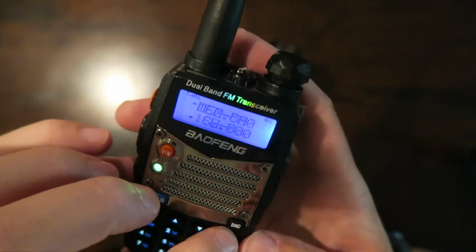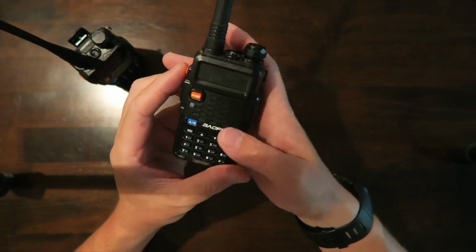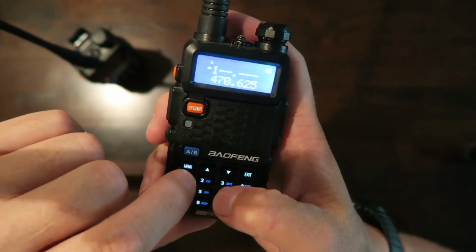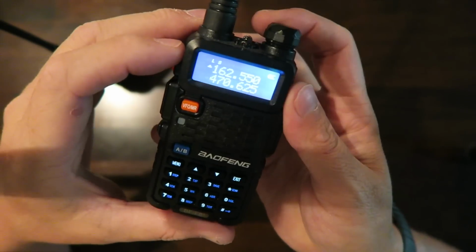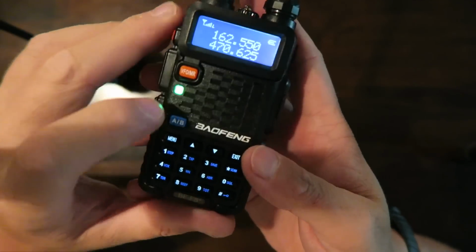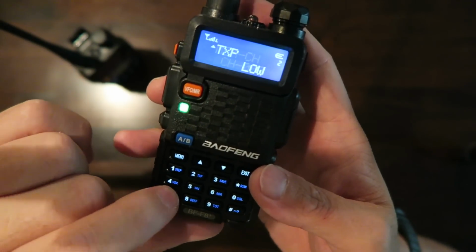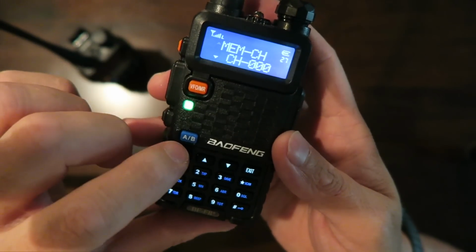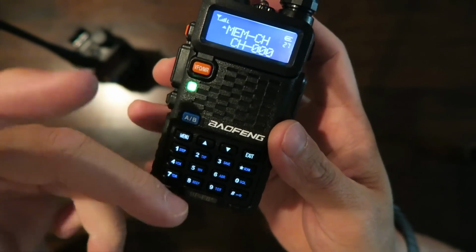I can show you the same thing over here on the BF-F8 Plus. If I type in the weather channel here, 162550, you can hear that the weather is coming in. Now if I want to store this, menu, we can go to 27, memorize channel. We can put it into channel slot 0.